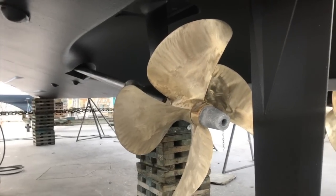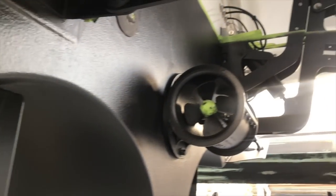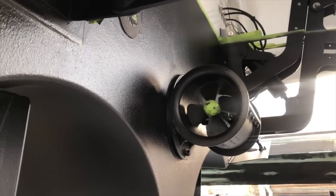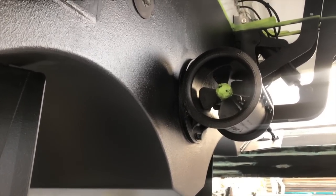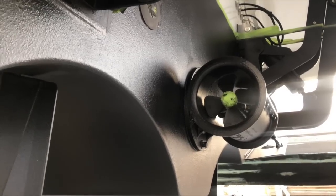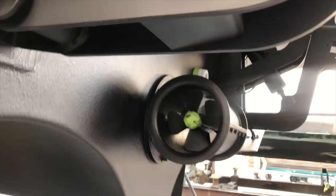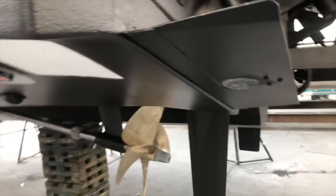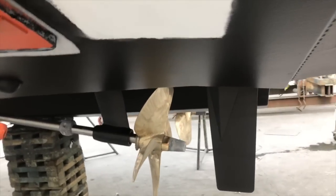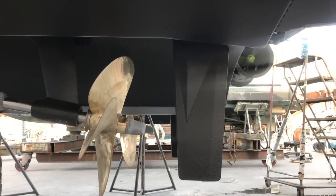Now what they've done here to counter the IPS maneuverability is they have installed a stern thruster. The stern thruster itself will give you 360-degree turning between the bow thruster and the stern thruster. I'll show you some demonstration videos of this — I've done this on the smaller sister to the Velasco, the 37F, on the videos. That right there is a really nice complement to the vessel and its maneuverability. We have very large rudders. The rudders found on the Velasco are quite large for this size of vessel and really innovative in their design as well.